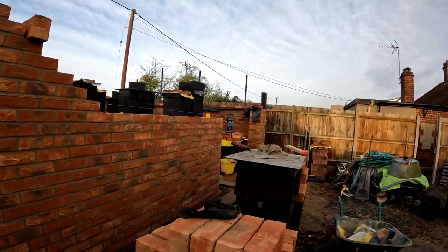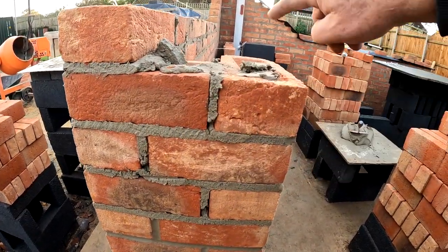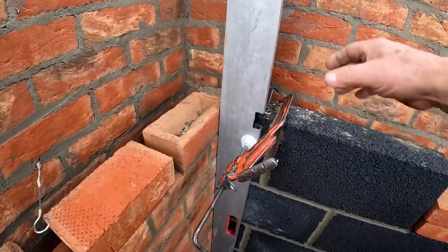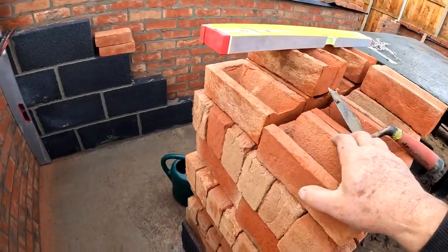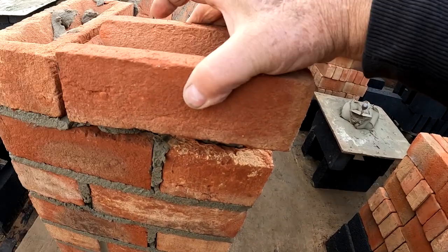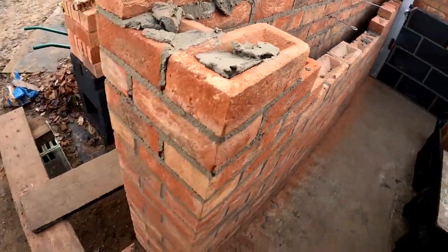Get this in, get that up there. What I'm doing here is I'm returning this brickwork - there's going to be a garage. They cranked me a profile there. I'm only on my level and I can pull a line through there. I've pre-cut all my bits of brick - done a left and a right at 185. They've all been pre-cut, done them yesterday. So I rag that back and then I can get that front up. That's a little bit awkward, but that's the effect I want.